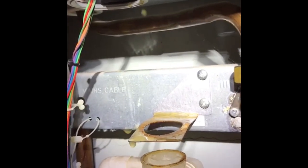That's the trap removed. I'm just catching the water in my bucket because inside the combustion chamber it's absolutely riddled with water. I took the trap off and inside the heat exchanger you're under the flue way - the gray bit there. You undo that and twist it to the left to give you enough room to get clearance to get the heat exchanger out. At the top you've got a bracket with a slot in it, and you lift up the heat exchanger so the bracket comes out of the slot and the heat exchanger comes out in one.